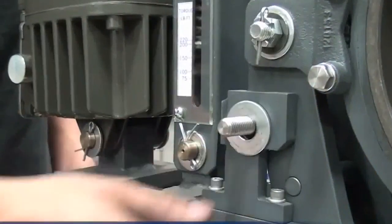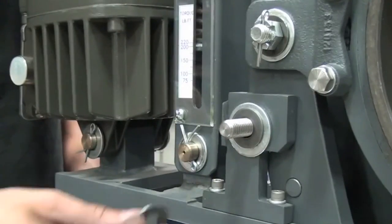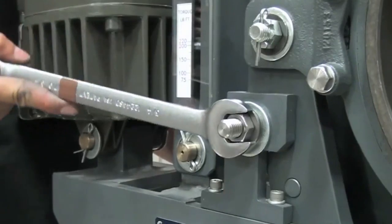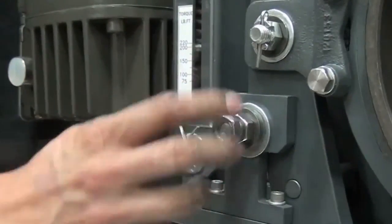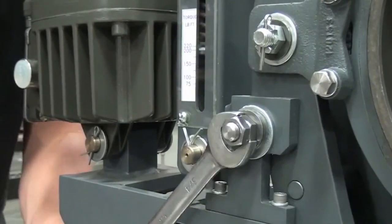When adjusting the auto equalization, the back of the shaft, which is not shown here, should be locked with a flat washer, a Belleville washer, and two jam nuts. Add a flat washer to the front of the AE shaft followed by three Belleville washers oriented in this manner. Place a nut on the shaft after the three Belleville washers. Tighten the nut on the front while holding the back assembly until all Belleville washers are flat, then loosen by approximately 180 degrees or half a turn. After the first nut on the front of the shaft is tight, add either a castle nut with a cotter pin or a second jamming nut to lock the auto equalization.